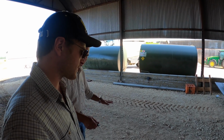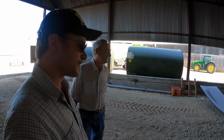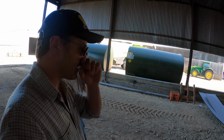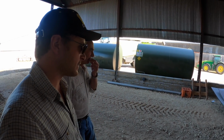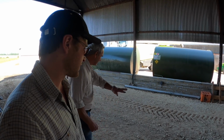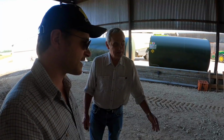Yeah, so we've got to get some levels up here. Probably compact this initial stone down. Yep. Because we just put it in, you rolled it with the... rolled it L53 and flat roll. Yeah. We probably ought to get at least a whacker plate. Whacker plate, yeah, get this all leveled down here. Then we need Ollie with his laser, and I think he'll want a little bit more to get it dead right. Obviously, we're going to have the reinforcing mesh, and then the concrete.